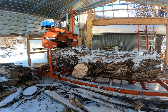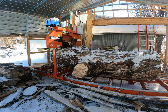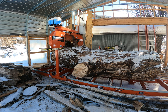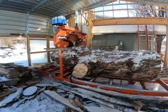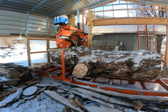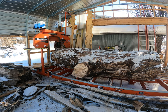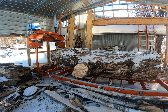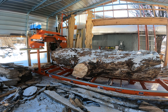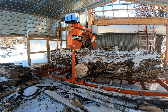Isn't that pretty? This is just taking off the first little top piece, but that's the excitement — that's how fast that sawmill head goes. It is winter so the log is frozen, which takes a little bit more to get through. Thank goodness we speed things up for video because this would take about four hours to watch in real time. Once you start seeing what you have and thinking about what you want to cut and what it might get used for, that spalting on the outside edge is just beautiful. I wanted that more for lumber so I just started doing four-quarter cuts off of that.